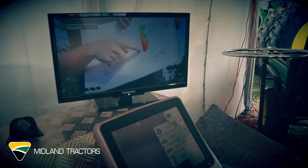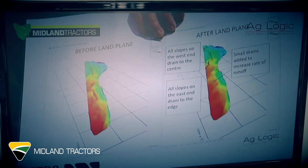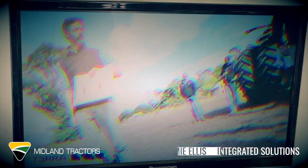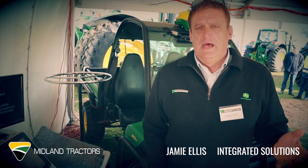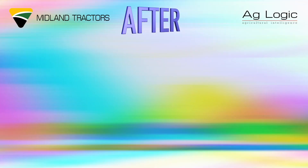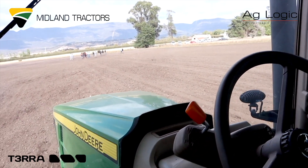What we're looking at here on the screen is a product called TerraCutter along with another product called iGrade, which is a John Deere product. Basically iGrade is a laser leveling replacement — not using laser but GPS — and it does basic land leveling, single plane and dual plane. Another company called Terra, in conjunction with John Deere's iGrade, makes that product work a lot smarter so you can move a lot less dirt to get the same result.